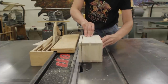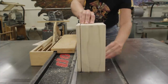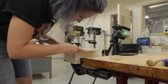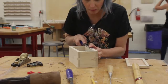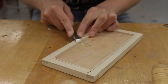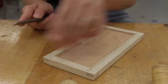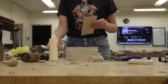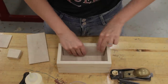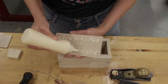I figured we would just cut the entire lid off with the table saw, but Eric was telling me that sometimes that can cause pinching. So it's best to cut most of the way with a table saw and finish with a handsaw. After the lid was parted from the box, you guessed it — more chisel work. Off camera we had cut and milled some quarter inch thick pieces of maple to use as box liners. They were easy to miter, drop into place, and hold with some glue.